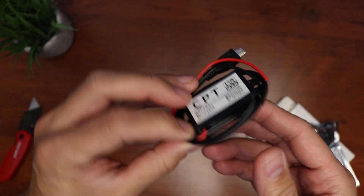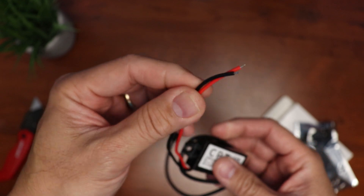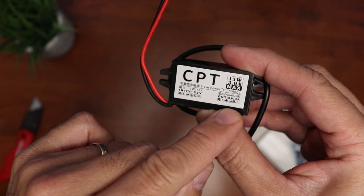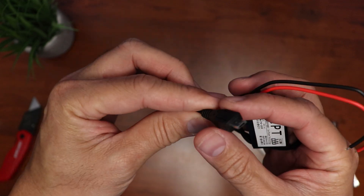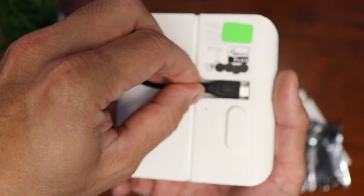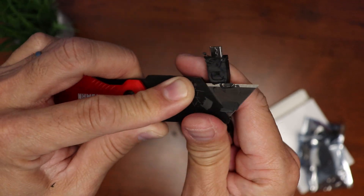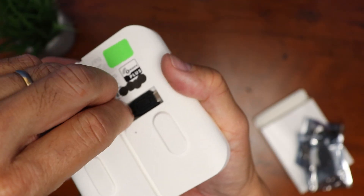Things that we will need. First, we need to have an adapter module, which I got at Amazon and I will link it down below. This will convert the 12V from your old alarm to 5V micro USB, so that it will be compatible with the Ring Alarm keypad. Now as is, it will not fit the micro USB port on the back of the keypad because the plug is a bit too thick. So you will also need a sharp blade or a utility knife to shave down the side of the plug that rubs on the keypad. Do this slowly and just shave off just enough for you to be able to plug in the micro USB.